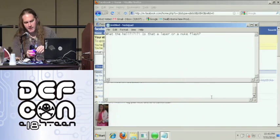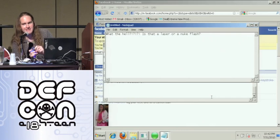But I also have a payload on there, and I think you may have seen that one in the listing when I did my diagnostic, called motion sensor. Essentially all it's doing is using the photoresistor to see a change in the value of light. Generally, if someone moves, a shadow happens, something gets rearranged, light reflects differently. It's a great way to detect motion.